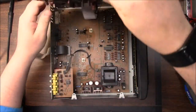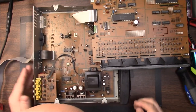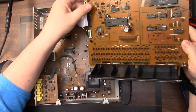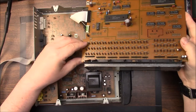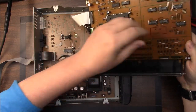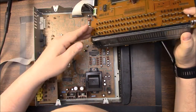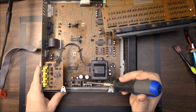Let's see what we've got going on. The board comes up — yes it does — and this has the display and everything, which is kind of unique. It does smell, and whatever is stinking has a definite bad odor. I'm looking for a cracked capacitor that's blown on the bottom. Right here, this capacitor looks like it went bad. Let me zoom in a little bit.